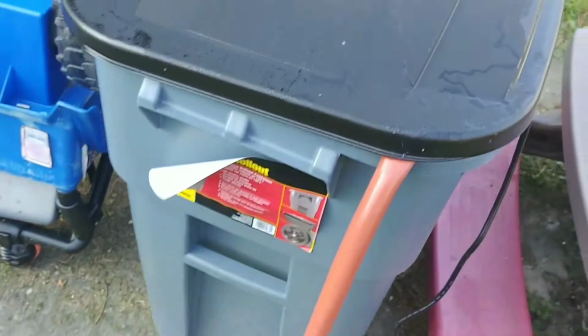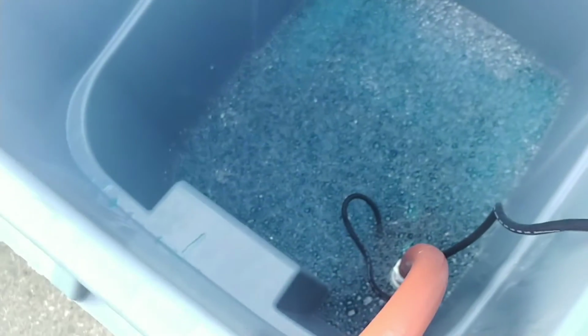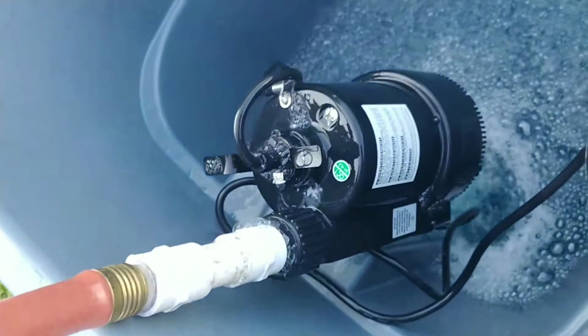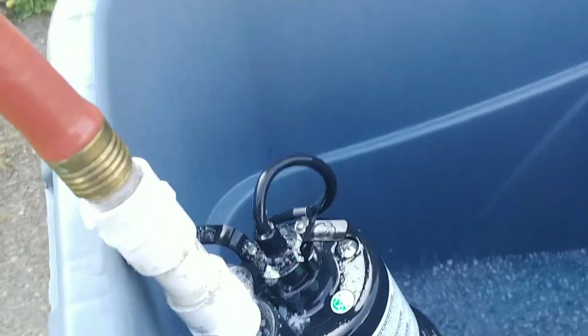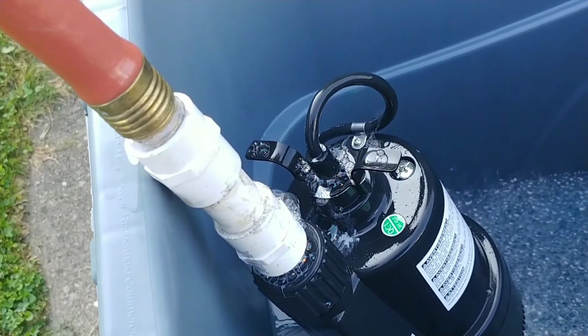So you hook this end of the hose up to that PVC, just 3/4 inch standard hose, adapts right to PVC, and that hose goes up and into my trash can here. The trash can is what holds your water reservoir. This hose here is adapted to my sub pump. This is a 1/3 horsepower sub pump. I will also put the link in the description. And this here is 2 3/4 inch female adapters and a small piece of pipe in between.